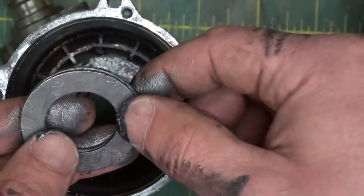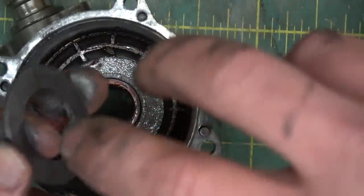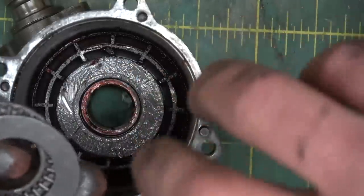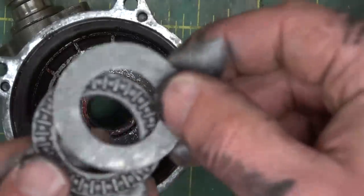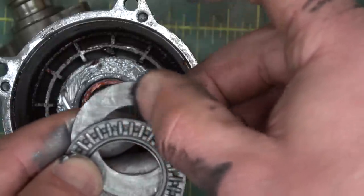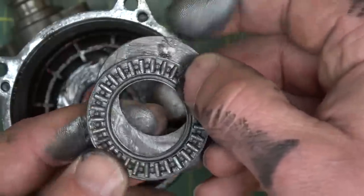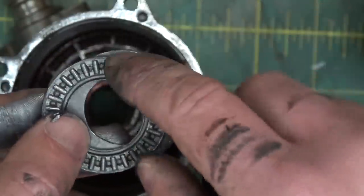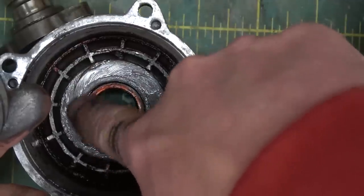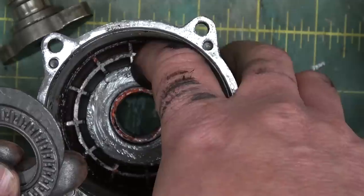Never-Seize is not to be used as grease, and I'll tell you why. Because it contains abrasives — when you put the fastener in, there is sand, silicon dioxide in there, in order to kind of clean up that hole and prevent it from galling over. It's like a bearing material — very fine particles of abrasive in Never-Seize. So you never want to put that on a bearing. However, the bearing itself — there's no brinelling on the race face, pins are in good shape, and the bearing cage is in good shape. Also no brinelling on there.